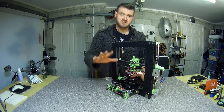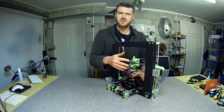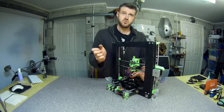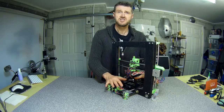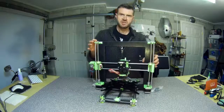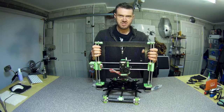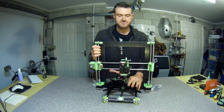My plan is I'll make some kind of housings for the electronics with the new printer once it's up and running. I've got external fuses and I'm probably going to run an external solid state relay or big MOSFET to handle the load - I'm going to put 24 volts on the heated bed. So I'm just going to get the electronics on the bench, wire everything in, and get it up and running. The next thing on the list is to put the heat bed on with the thermistors and all the wiring for that, and then the electronics.